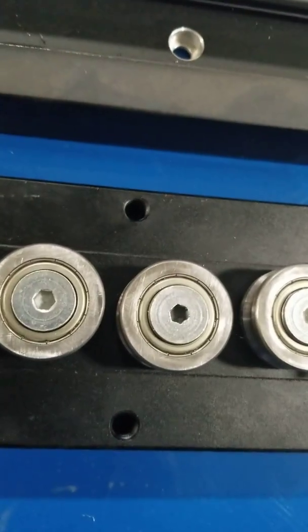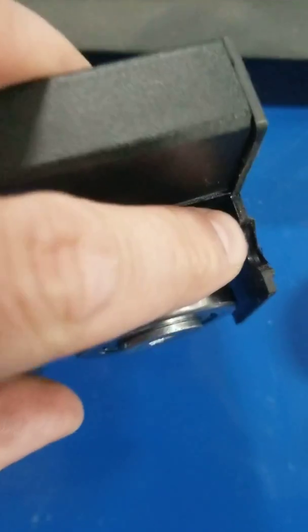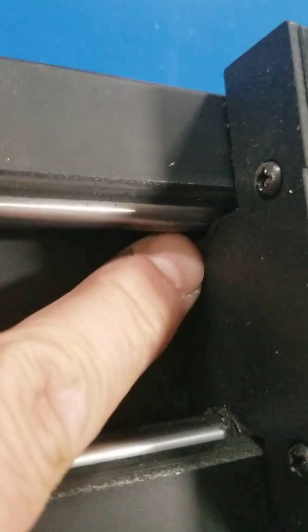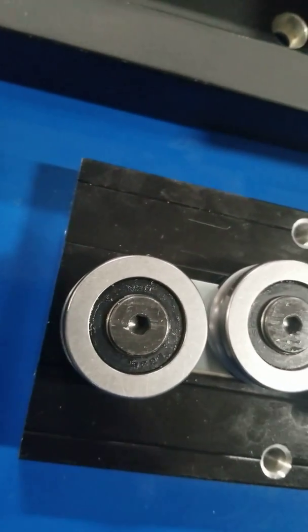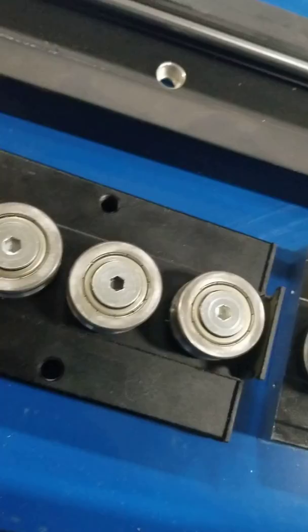Looking a little further into the rails, you look at the wiper systems. This is a thin little piece of plastic with a rubber scraper, and on one side it looks like the rubber scraper is sitting on the rail. On the other side, it's completely open. This is a horrible design — it doesn't scrape or clean the rail. Although these wheels are gothic arches, they still need to have a semi-clean surface to ride on.